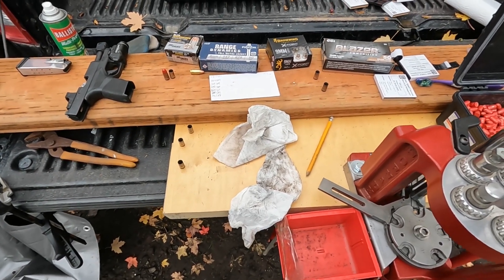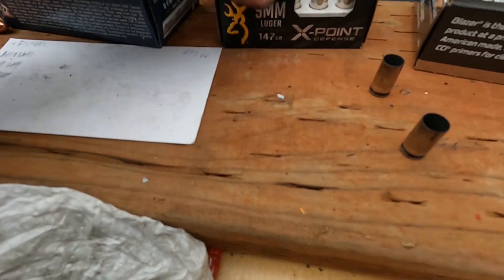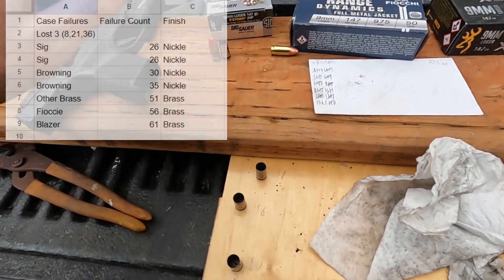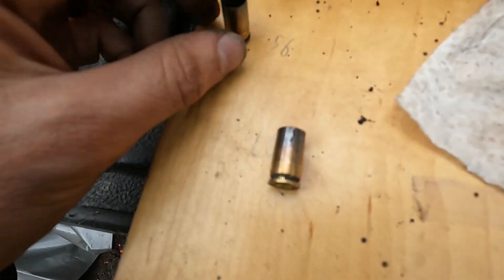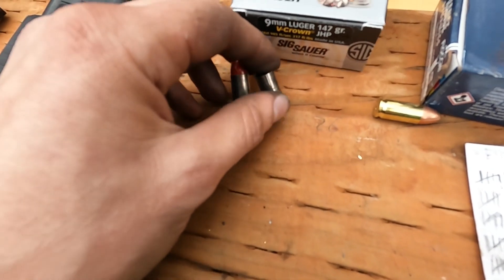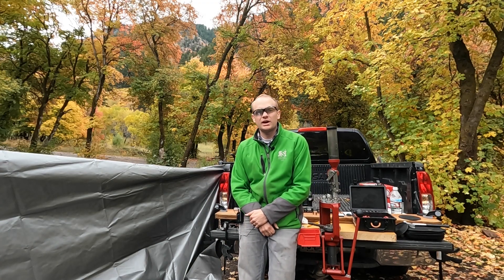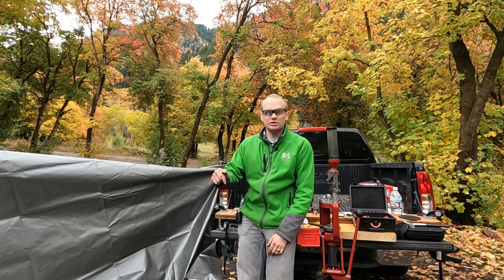They have all failed now. The SIGs were first to go — nickel-plated self-defense — at 26 reloads. The Brownings were second, also nickel-plated, at 30 and 35. The brass ones — Blazer, Fiocchi, and the other one — failed at 51, 56, and 60. All failures look the same: cracks along the neck or cracks along the whole body of the case. For pistol rounds like nine millimeter at similar pressure, you're looking at brass between 45 and 60 reloads, and nickel-plated between 25 and 30. If you have any comments or experience on this, please put it in the section below.